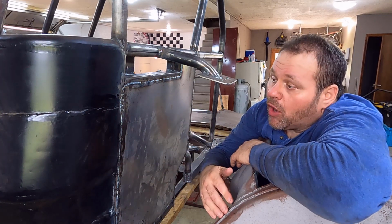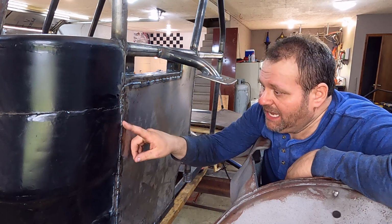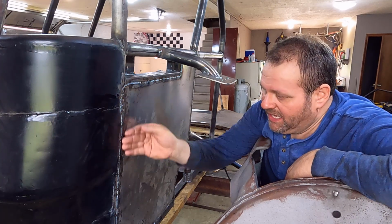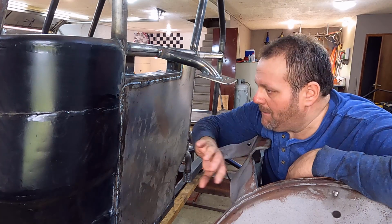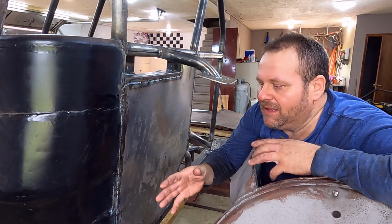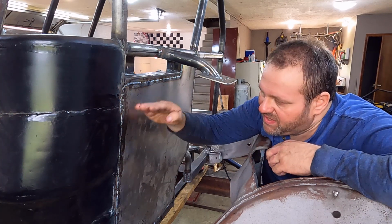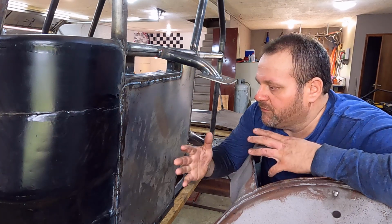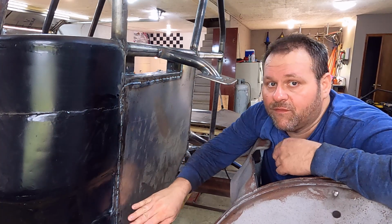However, the dirt coming off my left rear is going to be hitting this wall, and if I leave this crown down through here, it becomes this point that gives it an attachment place. So even if I've got this painted good and I've got mud off sprayed on this, it's going to want to hold on to dirt really bad, make it a pain in the butt cleaning this car off, because I have to physically scrape every bit of this dirt down through here every time. And so for that reason, I'm going to take a flat disc and clean that off.